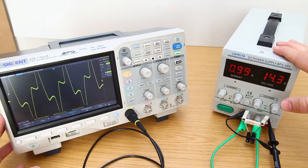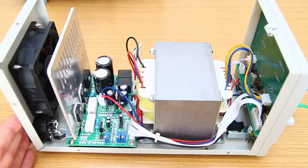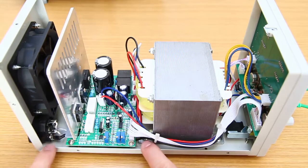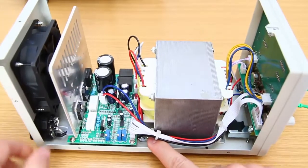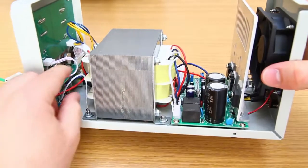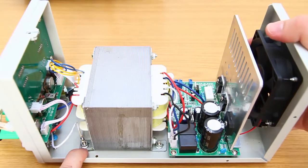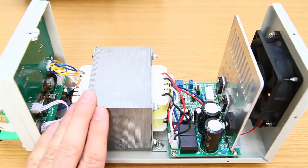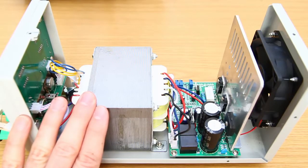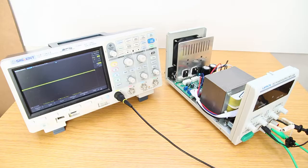Now let's open up the power supply and see what exactly is causing this. Take a look at how the ground terminal is wired in here. The ground from the mains plug is screwed to this corner of the transformer — there is a tab, and this goes to the tab on the mains plug. The ground wire from the output terminal is screwed to the opposite corner of the transformer. Having the transformer in your conductive path is a bad idea. If you have a changing magnetic field flux across your conductor, you will have an inducted electron flow, and in this case this is probably the source of most of our ripple. We can actually measure it.